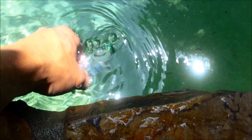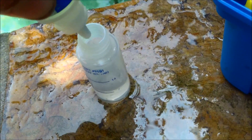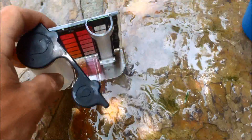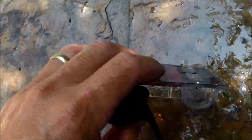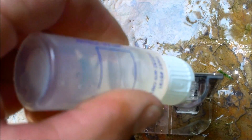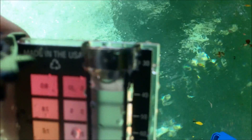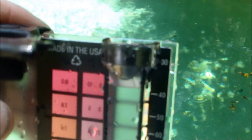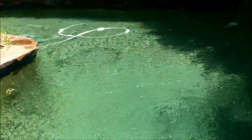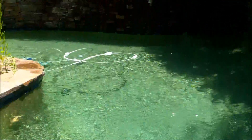Let's see what the Taylor Kit shows. Fill to the 7ml line, then add the reagent to the 14ml line. Put the cap on and shake for about 30 seconds. Since I did a test earlier, I'll rinse the vial out a little bit. There's the black dot on the bottom — fill it slowly until you can't see it anymore. It's showing about 40 parts per million of conditioner, so the test strip was pretty close at around 30. In a saltwater pool, nothing is being added to raise the conditioner — no trichlor tablets or dichlor — so the salt system doesn't put any conditioner in the water. That just shows you that the sanitizer has a lot to do with your conditioner level in your pool.